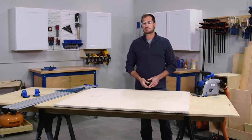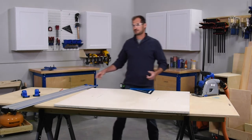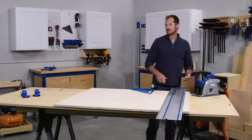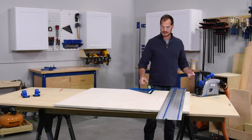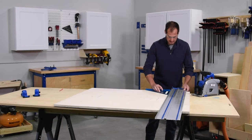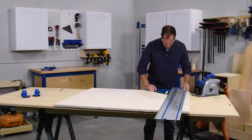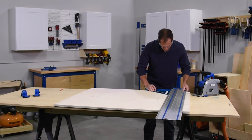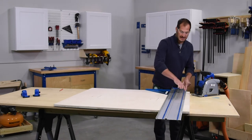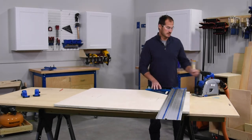There's an easy way to fix that with a track saw. You need a 12-inch speed square and your track, which you line up to a straight cut. This is the edge I want to square up, and then I'll square up the other side after this cut is complete. I slide the speed square over, make sure it's flush against the back side of the plywood, and then place my track against the edge of the speed square, making sure there are no gaps along the edge. This edge I'm cutting will be nice and square with the back edge I'm referencing from.